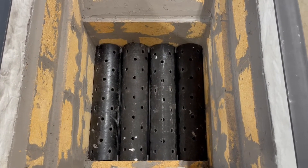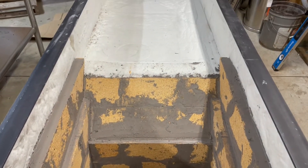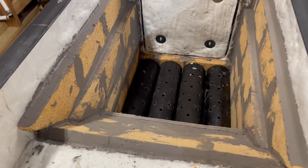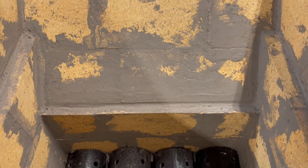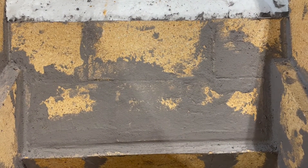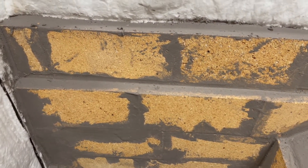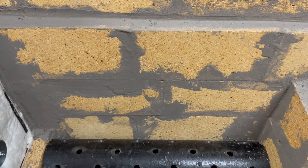We've finished bricking it up and this is what it looks like at the end of the day on the back side. Here's a close-up of all the sides - you can see on the back the thicker block for the first two courses, then the thinner bricks set on those, which forms a little bit of a ledge. The top course is a thinner brick, and the first three on the sides are thicker.